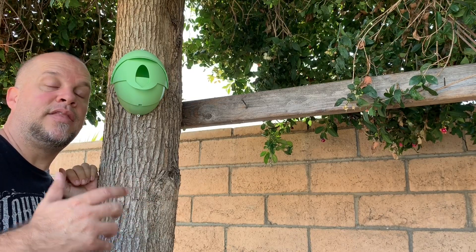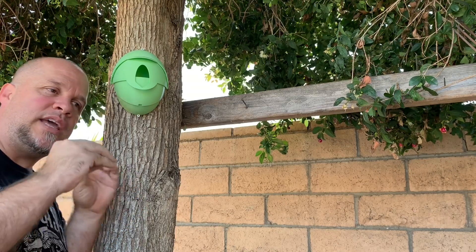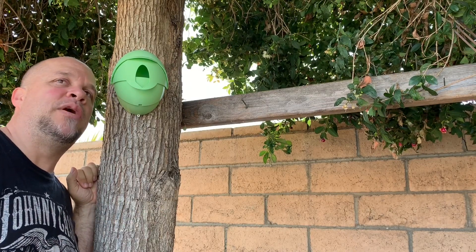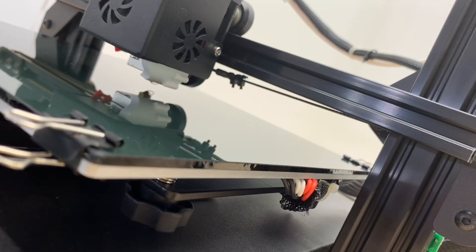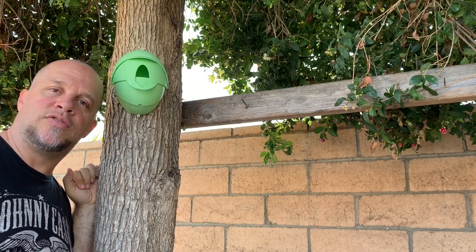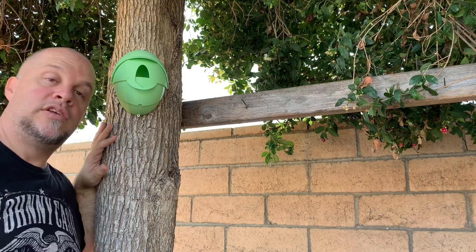Another con is the print bed — it's not very good and it's not level. The actual bed is warped, which you wouldn't expect when paying for something like this. You can level it yourself, but you need a really flat surface. What I ended up doing was putting a glass bed on it, cut at a glass shop near my home, and that almost eliminated my leveling issues. You can buy glass beds for this — I'll put those in the description below. They don't make one specific to the JG Magic, but Creality makes one that fits, and I'll link that in the description below.